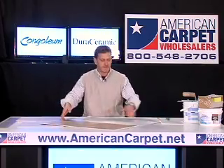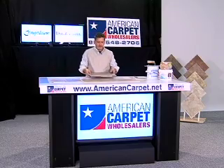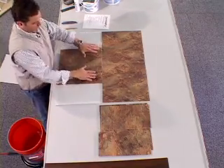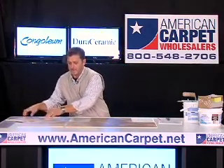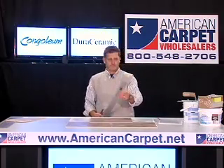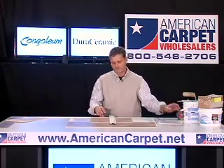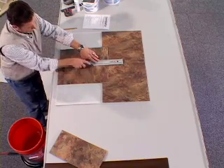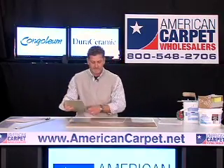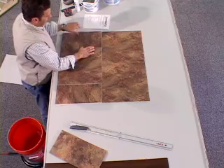The next thing we're going to do is a grouted joint. What we'll do there is place another tile located center, one eighth inch away from the two that are already down. Press firmly. Then I'm going to show you exactly how easy this is to cut. You'll just need a utility knife and a straight edge, placed in the center of your tile, and a tape measure to make your marks — that'll give you a reference point. Take and cut your tile, score lightly, you don't have to press real hard, and it's as simple as just popping it right in two. Space out one eighth of an inch, down you go, and down you go. Got a nice little grout joint.